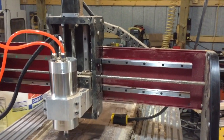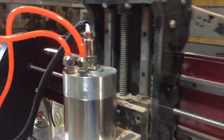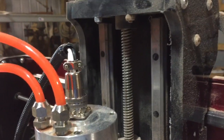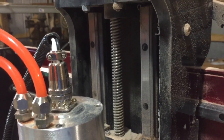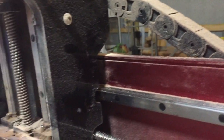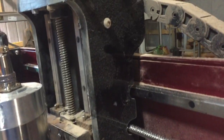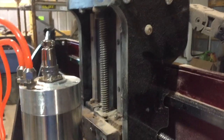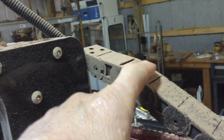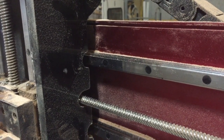For the recommended cleaning procedure on an HD5 — you can see I've been working it without dust control. I recommend running a filter to capture fine dust, and vacuuming off the heavier settled dust. After 30 hours, even in extremely dusty situations, it's a good time to clean your rail and re-grease it.